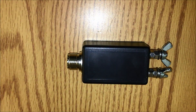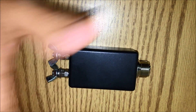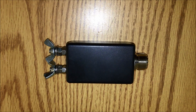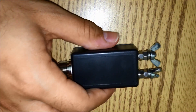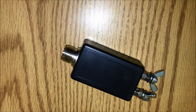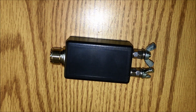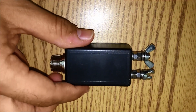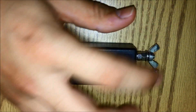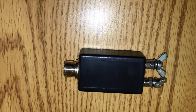Here's the last piece — this is a 4-to-1 balun. This particular one I got off eBay, it came from China, I think it was about $10. It's advertised as good for less than 100 watts. I haven't opened it up to look at it. I'm planning on using this for QRP so I'm not really too concerned. If you're using it for higher power, you might want to investigate that. This basically lets me convert between balanced and unbalanced — so from twin lead to coax. This is the last key in our setup. The feed line from the doublet will connect to these two screw terminals — I added wing nuts — and then we connect this end right to our tuner and get this antenna on the air.